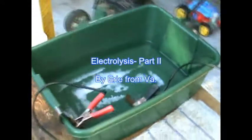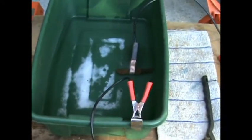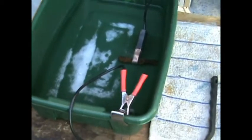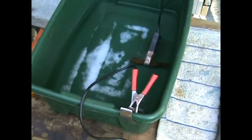I actually didn't hit the stop button. So basically what I do now is just walk away, let the tank electrolysis do its stuff, we'll come back in a couple of hours, maybe an hour, take a look and see what we've got, do a brush down, and if it needs more time in the cooker then we'll put it in there for a little bit more time.